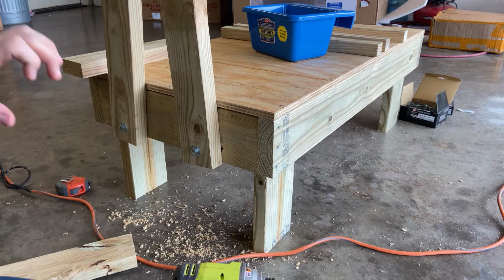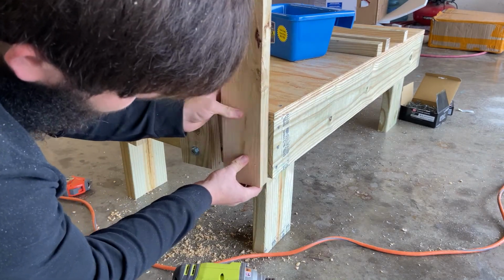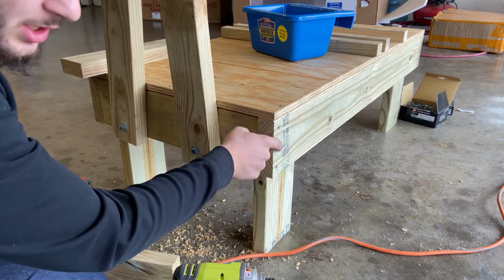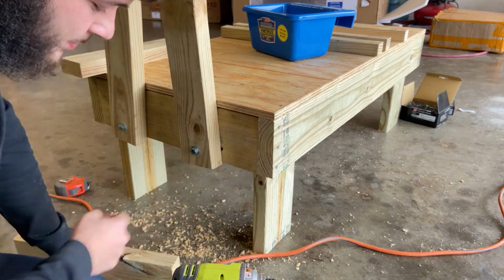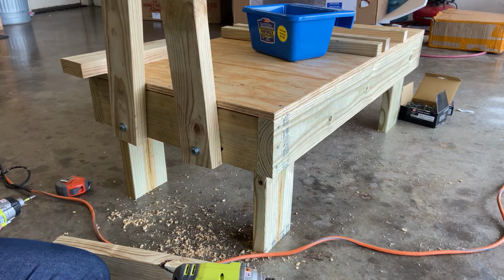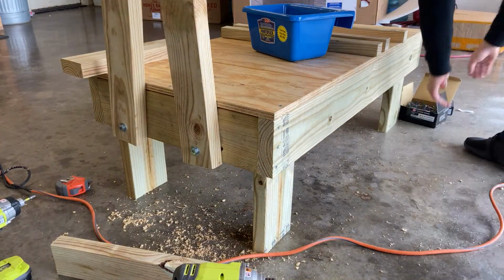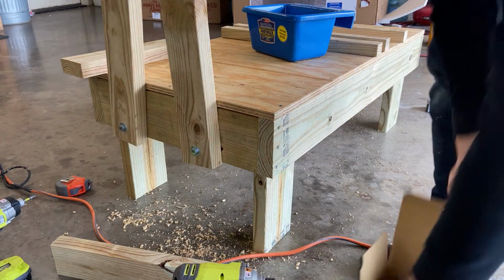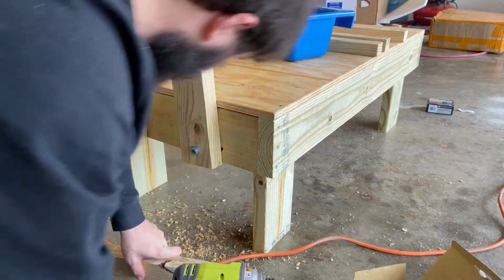Okay. So I drilled the hole, holding this up here, lining it up. This hole I drilled, there's 3 screws like you saw earlier. Went in here, I do it in between them to get that hole drilled, okay? And for this one, we're gonna use a fairly long screw. 2.5 inch screws, 3 inch, 4 inch screws, whatever. This 2.5 is gonna work perfectly.